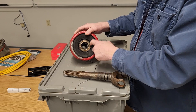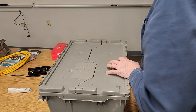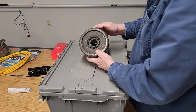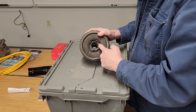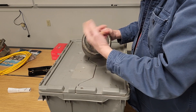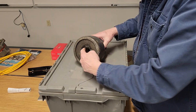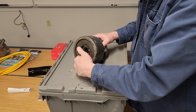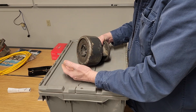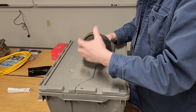Here is a good coupler — you can see that the rubber is nice and smooth all the way around. And then I have one that is a spun coupler. This is one I took off a 454 years ago, and you can see that the rubber has completely separated from the inner hub and spun out inside. That's basically from old age — what happened to this one. In that boat, they just basically couldn't go anywhere because the inner piece was spinning inside the rubber. Now if the engine is severely out of alignment — the motor mount fails, collapses, or loosens up and falls down — then you can have a catastrophic failure of the coupler.